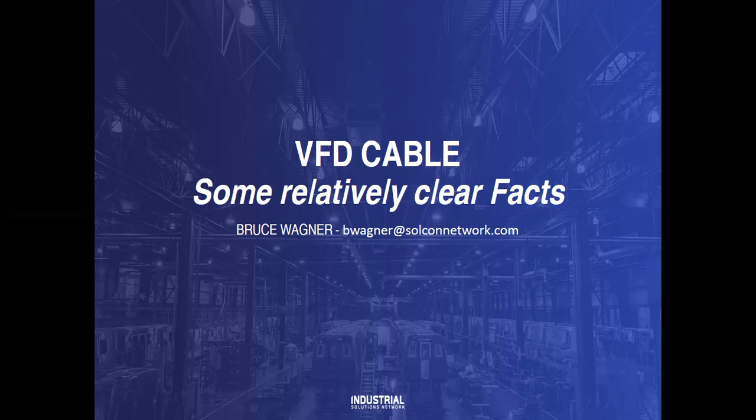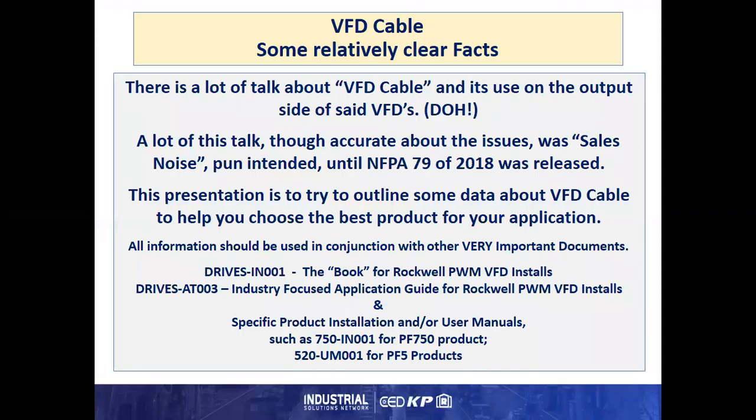Today I'd like to present to you VFD cable and some relatively clear facts about VFD cable and its usage. There's been a lot of talk about VFD cable for several years since the release of IGBT output style PWM drives. A lot of this talk, though accurate about the issues, was sales noise, pun intended, until the NFPA 79 of 2018 was released. This presentation is to try to outline some of this data about VFD cables to help you choose the best product for your application.